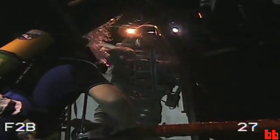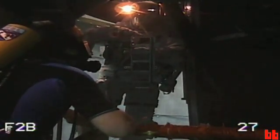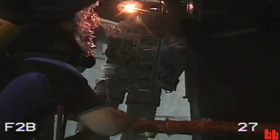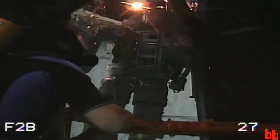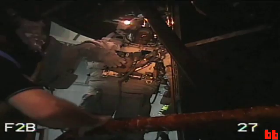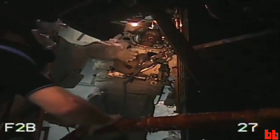The key feature of this fastener capture plate is it has plexiglass windows, and over each screw is a hole. The hole is big enough that a screwdriver can fit through it, but not so big that a screw can come out through it. So I'm going to release all the screws and they're going to float around in these windows and won't come out on the telescope. This repair was never intended to be done — this is all something we figured out after the failure. None of these screws were intended to come out on orbit.